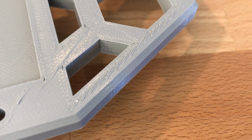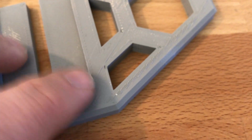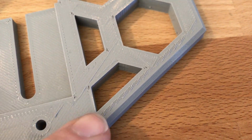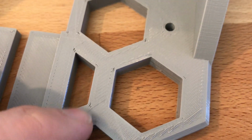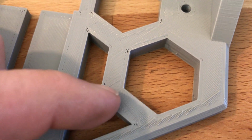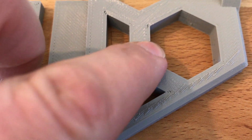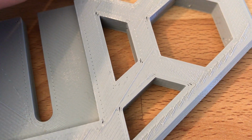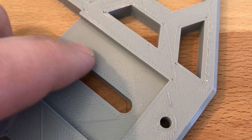It's very uneven. But even in other sections, I have a gap here as well. This pillowing here is where the printer stopped printing the infill, moved to a different section, and then came back and finished it from the other direction. So that leads me to believe it maybe looks a little over extruded, since there just wasn't room to lay both of those layers in after it had cooled. But in other spots, it certainly looks a bit under extruded, like at these perimeters or on some of the outline overlaps.